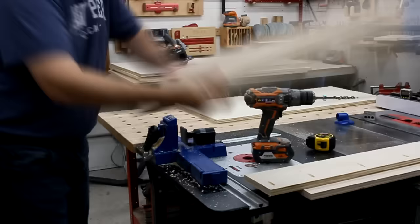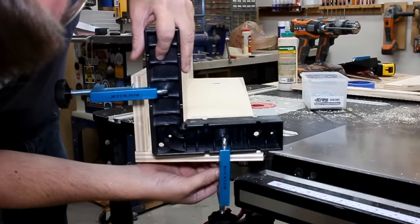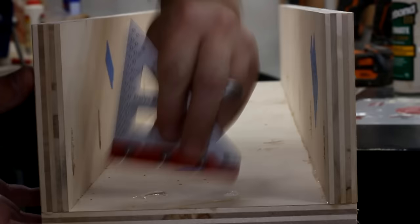And even more pocket holes. When gluing the pieces together, I was sure to use the clamp-it squares to not just hold things at a perfect 90 degrees, but also to prohibit things from moving when I'm driving in the pocket screws. They're really good for that. Once I got it together, I double-checked that things are still square.